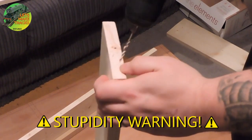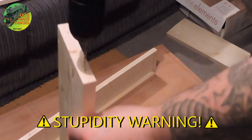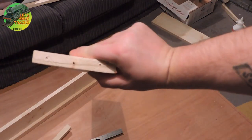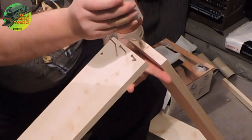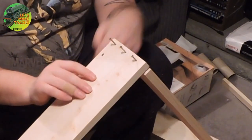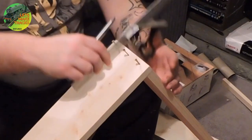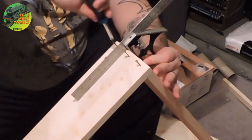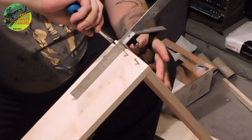The pilot holes are to help prevent the narrow board from splitting when the screw passes through from one to the other. Once everything is lined up and ready, add a little bit of wood glue just to help with the bond and then screw them together. Using my set square I make sure it's at a 90-degree angle and then tighten up all the screws. Rinse and repeat — that's how I put all the framing and the battens together.